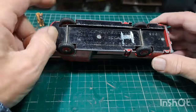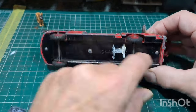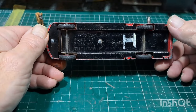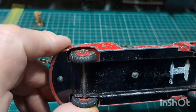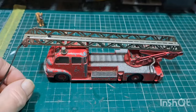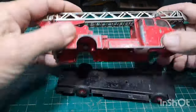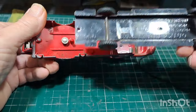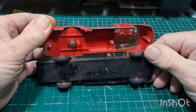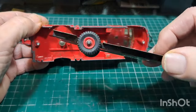Okay, what we need — we've got smooth nipple rivets. Looks like there's three; I don't know what that middle one's holding on but we'll find out. We'll drill it out from the front. Let's get the file out and file them first, then we drill them out. We've got room at the end of the axles to pin them over when we're done — that's another bonus. Okay, get the tools out. Right, we've got the base off. There were three posts on here — one, two, three — not quite sure what the middle one was supposed to do, but it's off anyway.